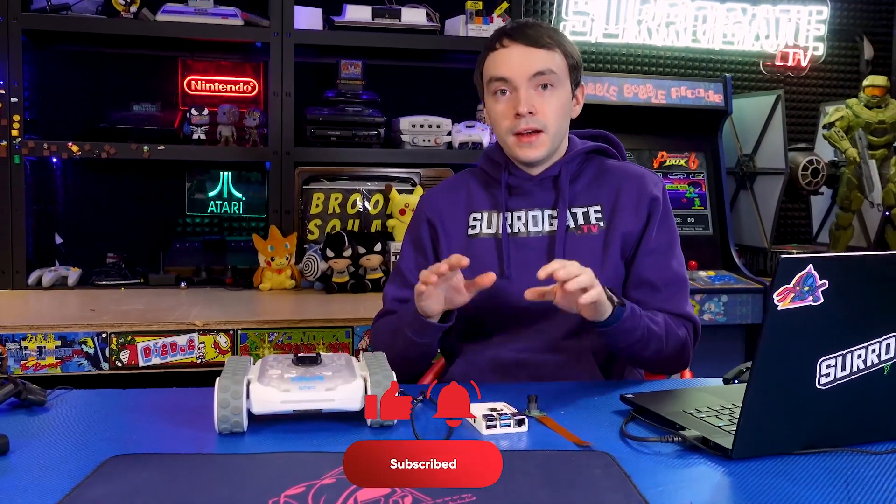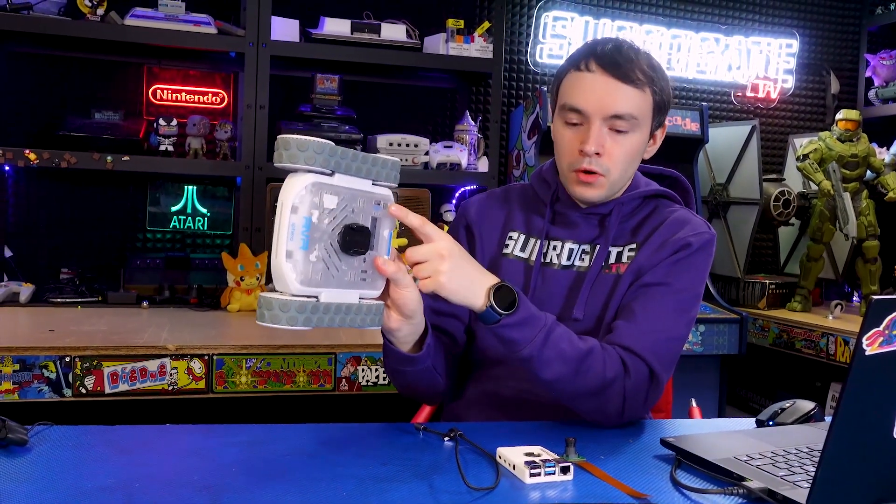If you're using a Raspberry Pi 3, in theory you could use a CSI camera with it and have no power bank — using directly the power of the Sphero rover to power your Raspberry Pi. However, we would not recommend doing that because your Raspi will run in low power mode and at some point it can just turn off. And if you want to do a quick and dirty job, also make sure to get some double-sided tape to attach everything to the rover.